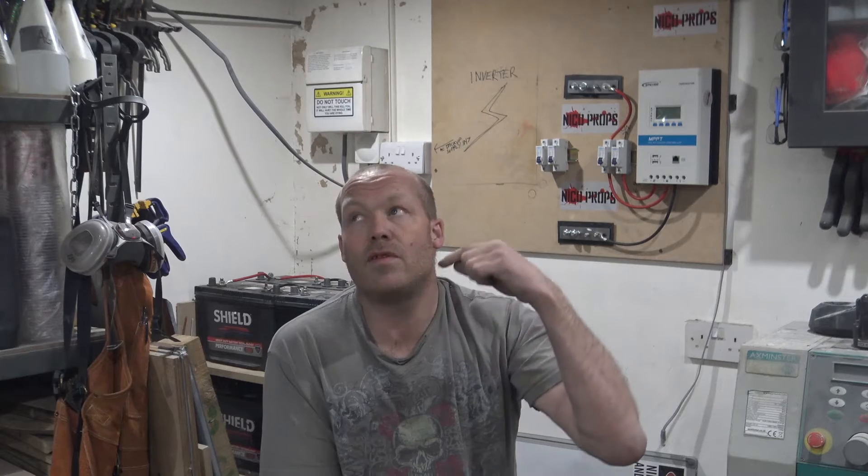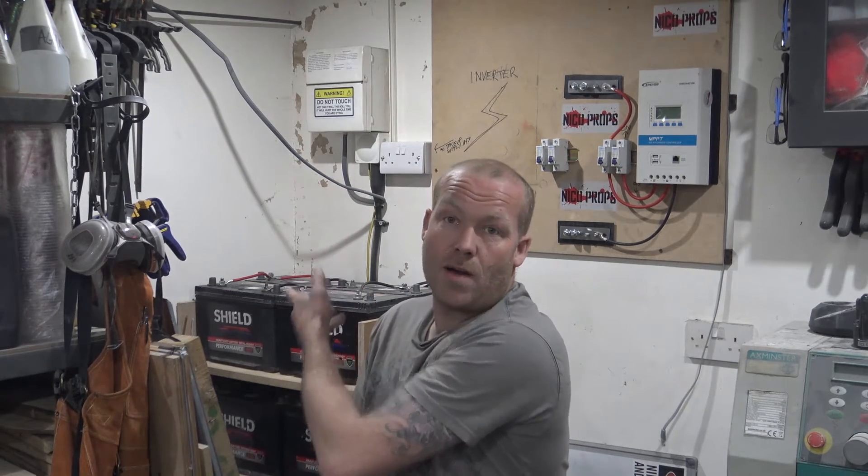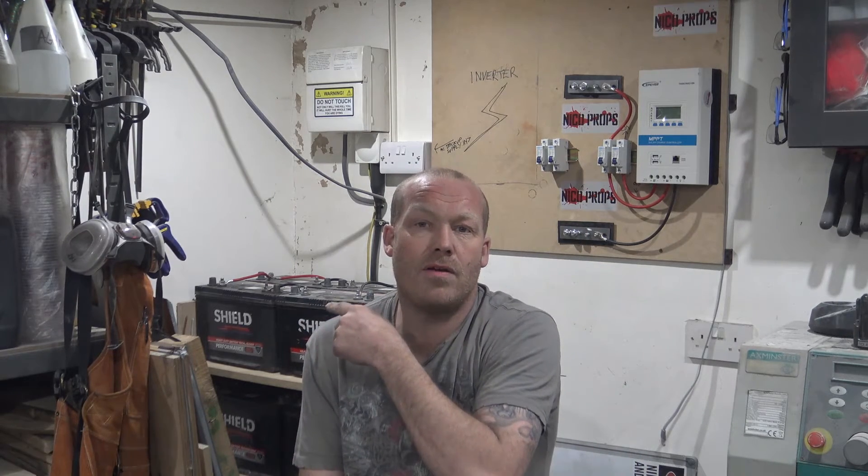You've also got to account for the wattage you're planning to use. There's a whole complicated formula. My choice was to go for a thick cable, but that could potentially produce heat running down on the floor — potentially dangerous. So I figured I'd move the batteries up. With this in mind, I need to keep the cable length as short as possible, so I'm going to rearrange all of this panel before I connect it up to the batteries, to use the space more efficiently.